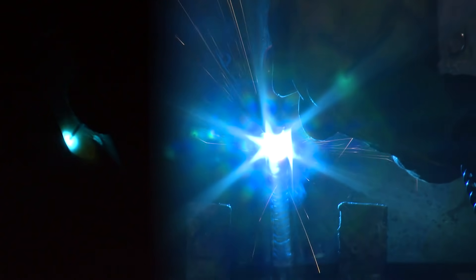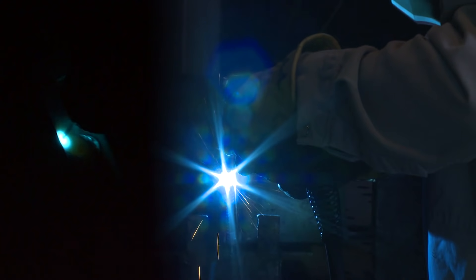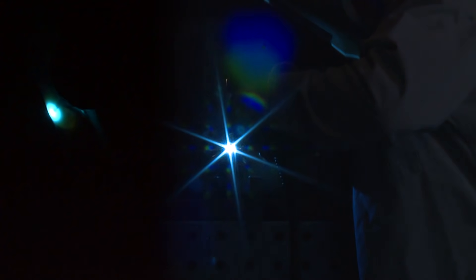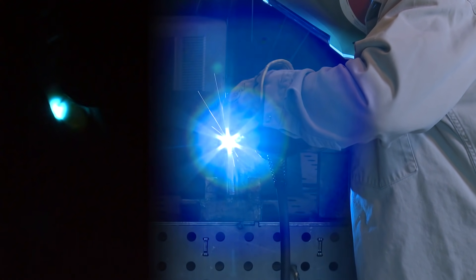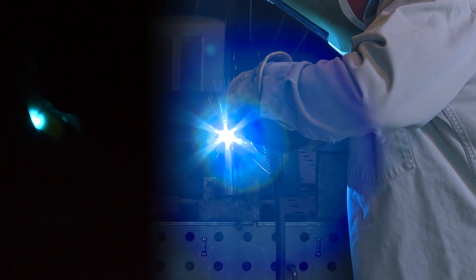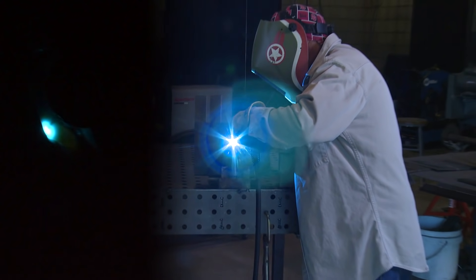Since I'm going to do this weld in three passes, I'm pulling this wire up in the center, pre-filling the center, and weaving to the outside about three thirty-seconds of an inch to my beveled edge. I want to leave my beveled edges alone because they're my guide when I go to do my cap. I want to run a straight cap. Trying to keep the same electrical stick out — simple, repeatable motion.